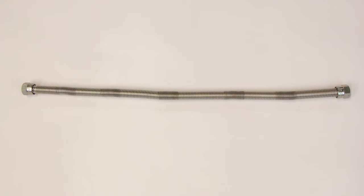One last tip. When connecting your natural gas line to the burner valve, we recommend using a noise reducing flex. As you can see from this image, the noise reducing flex has coils that are staggered to break up the harmonics as gas flows through this line. Failing to use a noise reducing flex can result in a loud and annoying whistle while the burner is in operation.